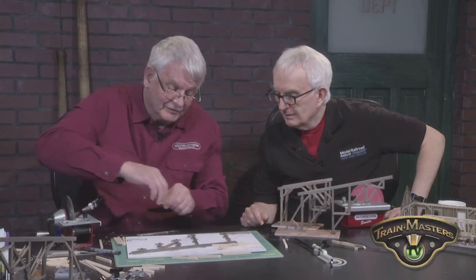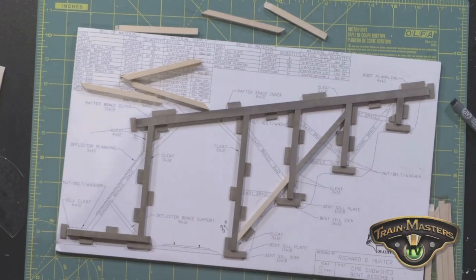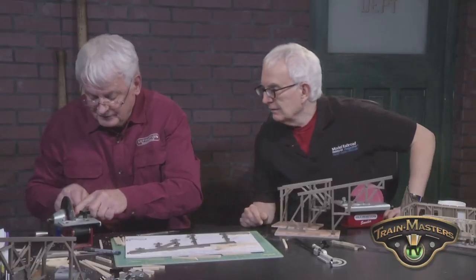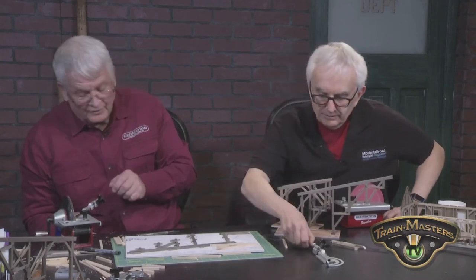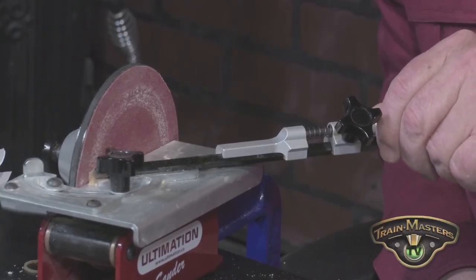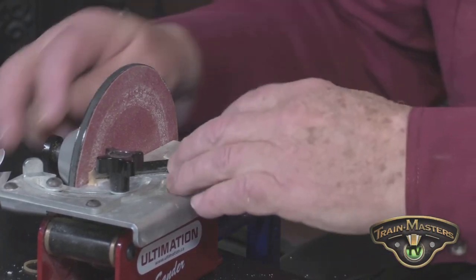And we probably only took a few thousandths of an inch off. All right, so that's one way of doing it. The other way is the same idea, except this thimble is graduated in thousandths of an inch. So something tells me that I want to take 5 thousandths of an inch off that. There's about a 5 thousandths of an inch gap in there.